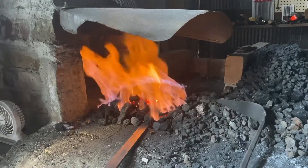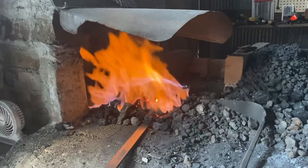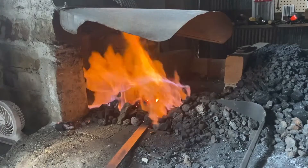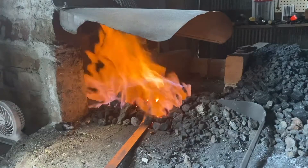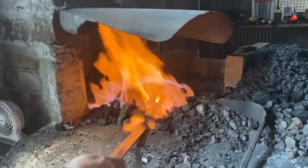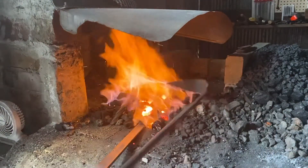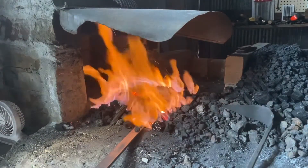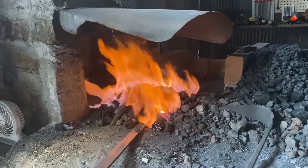Technically that's welding heat, but we're just going to watch this thing sparkle. We're going to watch it sparkle until we can't stand it no more. You see the sparks? We are definitely out of welding heat now, but we're going to keep letting it go. We are learning right now what burning the metal looks like in our fire, and what welding heat looks like in our fire.